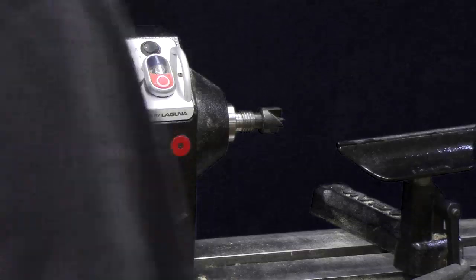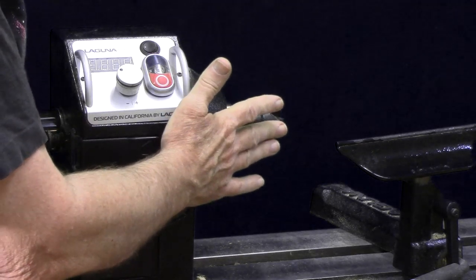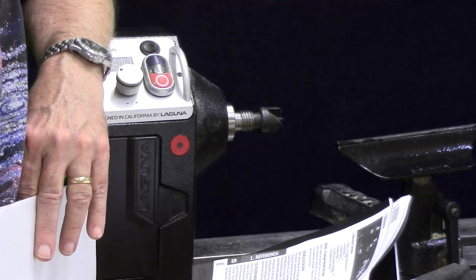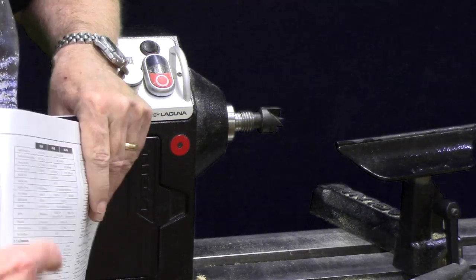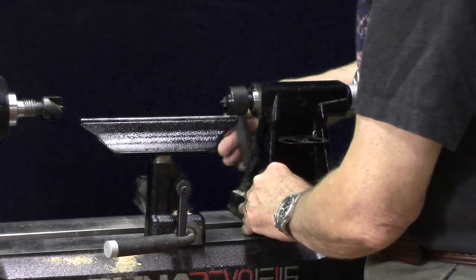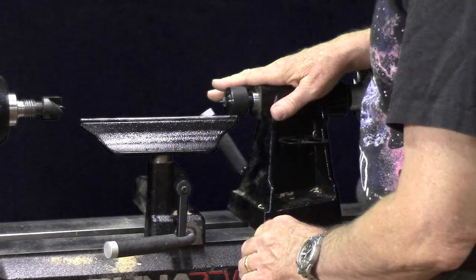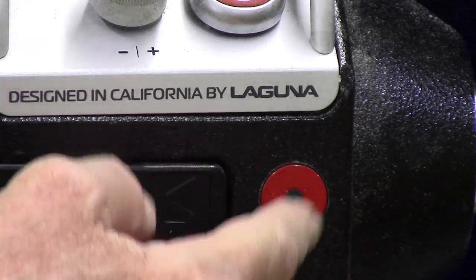Another plus is the cone design, which makes it a little easier to get in behind the backside of a bowl if that's the way you turn. Reading from the manual: 'By no means is this an introductory lathe. This is a small profile lathe made for professionals who favor smaller projects' — and I find that a pretty good description that fits me well. I love the beefy control levers to tighten the banjo and the tailstock; they both have rubber on them, are a very good size, and lock well with a cam lock action. It also has a very effective spindle lock — you have to hold it in for it to work, and if you take your finger off, it releases.